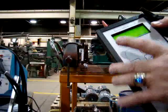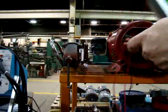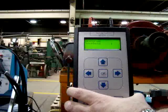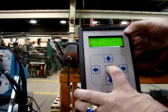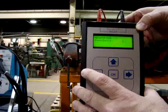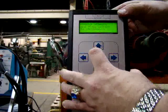For the ALL-TEST equipment, we're going to go ahead and do the auto mode. Short the leads together. Connect the winding, run the test — phase one. Connect winding two, run the test. Connect winding three, run the test.